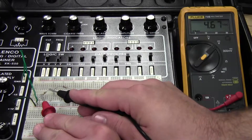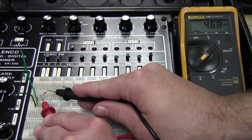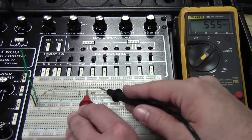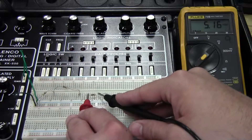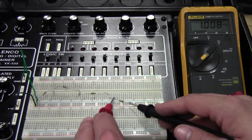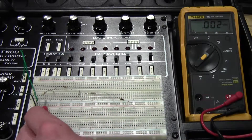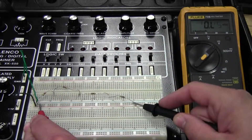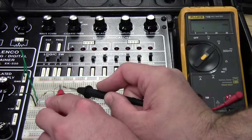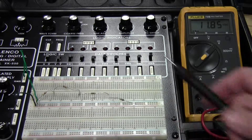Just like measuring resistance, but now the power is on. The voltage drop on the 470 ohm resistor is 4.68 volts. The voltage drop on the 100 ohm is about 1 volt. On the 510 I've got 5.16 volts, and on the last 100 ohm again about 1 volt. Those voltage drops add up to my source voltage — measuring from beginning to end gives a source voltage of 11.85 volts.